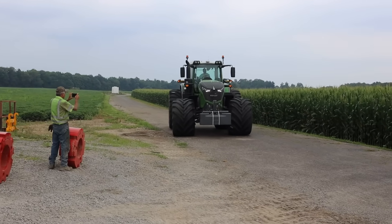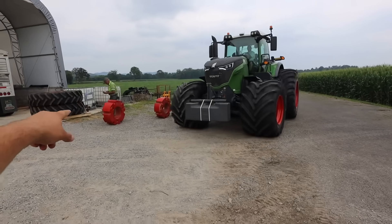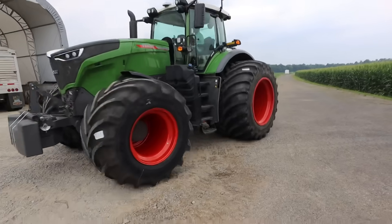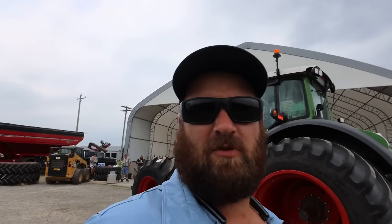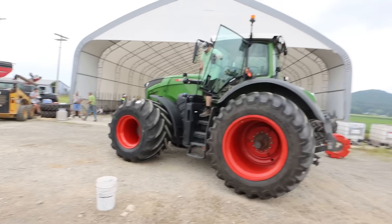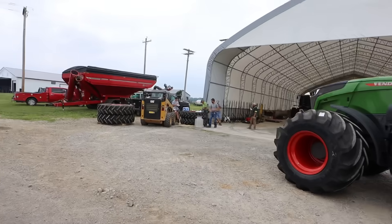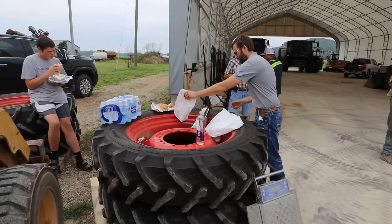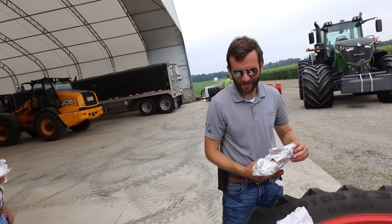So right now we're driving the tractor back and forth a little bit. Those wheel weights have to go back on, but we have to torque the wheels first. We cannot reach those lug nuts once the wheel weights are on. So we're going to drive around, make sure everything's loose enough and tight, then we're going to tighten everything up to spec, put the wheel weights on, then we'll be done. Then we'll actually put the tractor on scales and adjust the air pressure accordingly. It's one o'clock — we'll have some ham and cheese subs. An LSW would have made a little bit better table, I believe.